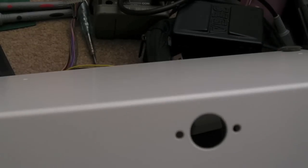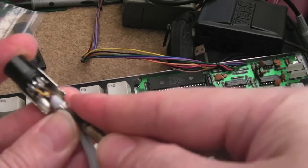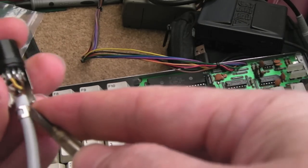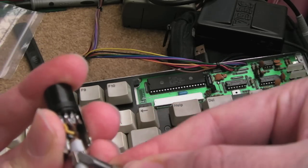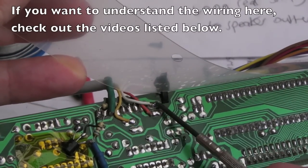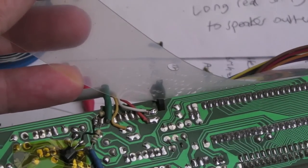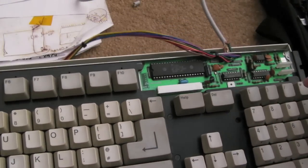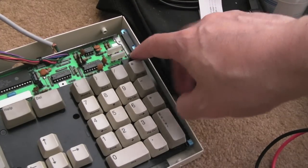I've asked the question on Twitter and on my Discord. I've tried them on my 1200 — they're not good there either. So what I'm going to do is: I've ordered a panel-mount connector for this, but in the meantime I'm just going to solder one side of this directly on. Nothing is lost doing this — buying this cable for a few pounds meant one side is already wired and we get a free connector as well. So we're all done: the yellow wire coming to that pad, the red one to here, white to there, ground is the third one down — just those four wires.